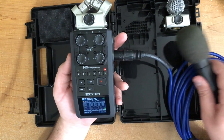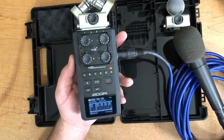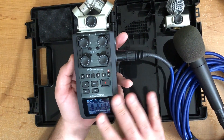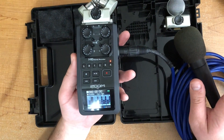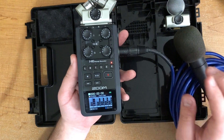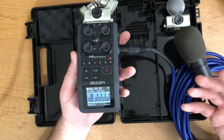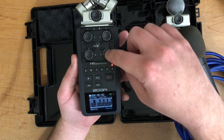That's pretty much it — go around and check the same input level for all four mics. I definitely recommend having headphones for setup. You don't have to wear them for the whole recording — it's ideal, but if you don't have a way to plug in four headphones for four people, that's understandable. But when you're setting up and testing the mics, definitely have headphones plugged in so you can make sure it's not clipping. You'll be able to hear if the voice is getting distorted, and you want to get a good balance between all four mics.